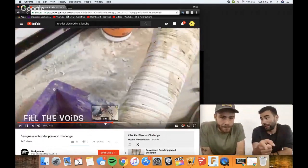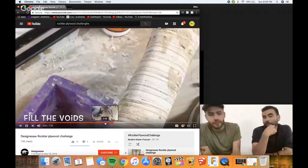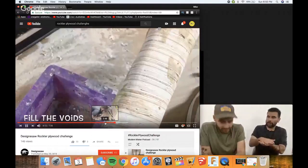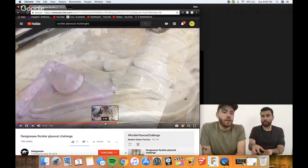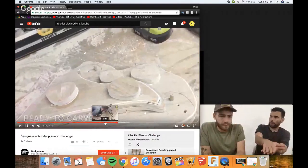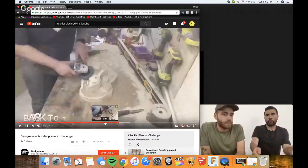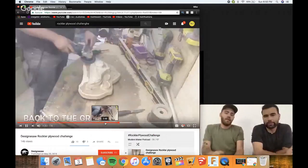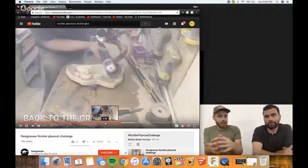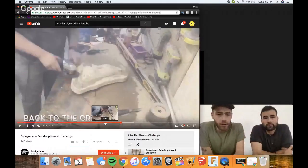You use weight plates to hold things down. Boom. Like a good 45 or 25 pound steel plate, they're so flat you get a really clean reference line, and you don't need to clamp. You can just throw something onto the middle. If you're gluing two pieces of plywood together, a 45-pound weight plate is way better than clamps a lot of times. Yeah, because you got so much surface area too. Instead of focusing it on this one clamp head, you spread that same weight across the whole thing.